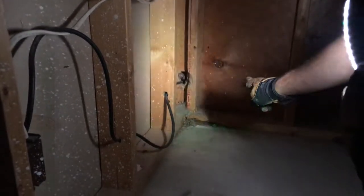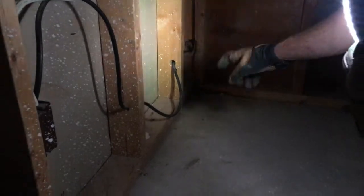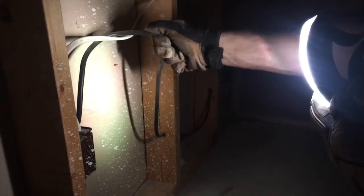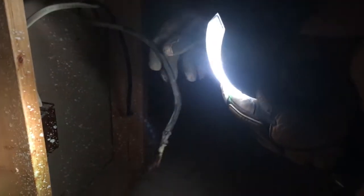There was definitely some mice droppings, and this is an extension cord — you can hear it, it's gotten crispy. Beyond the fact that I was trying to trip the breaker and couldn't, it was a high impedance situation. They came into this outlet right there, and that insulation is already toast. It's not a UF-rated cord for underground direct burial — it's stranded, not solid.